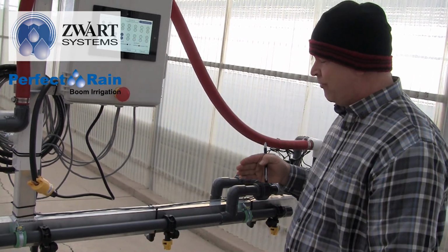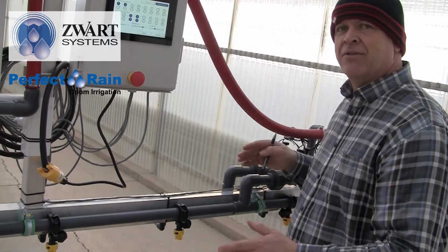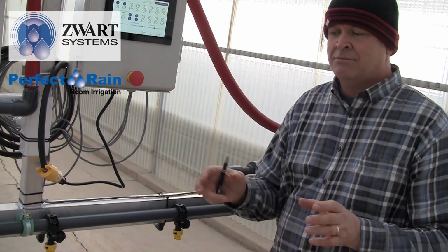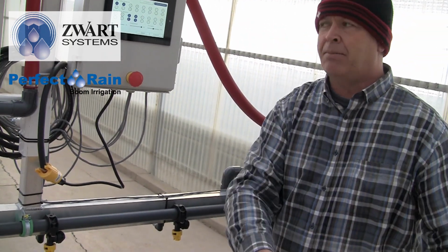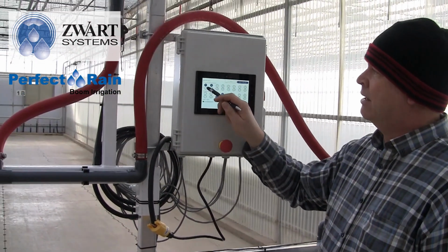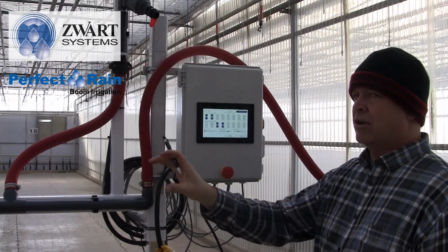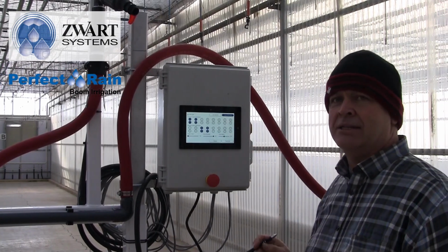We're going to want this valve to do that first row, but then the back valve to do the offset row, so that I get my left, right as I step through the pots. That's why when we go to the controller, we are going to be selecting the forward 1 and 2 valves, so that I can go back and forth on the left, and 3 and 4 on the right.